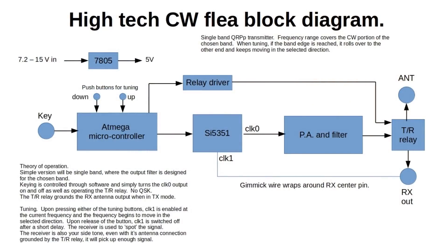It's a very simple design — I wanted to keep it as simple as possible and easy to put together, so tinkerers using today's tools can build their own low-power CW transmitter. There is an analog component: you'll need to wind two or three toroids for the low-pass filter, but they're easy. There's also a transistor to drive a relay for transmit/receive switching. The main blocks of the transmitter are an AT-Mega microcontroller, an SI5351 clock generator chip for the VFO, a transmit/receive relay, and a power output section. Inputs are just a Morse key, power, and tuning.